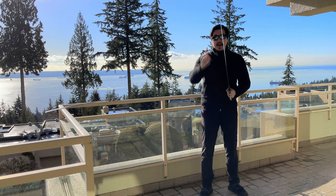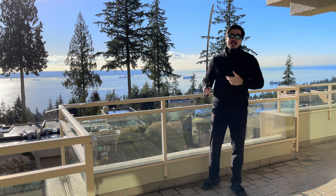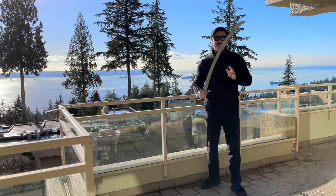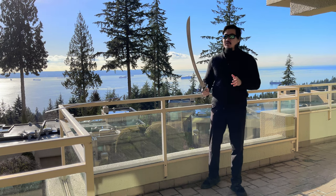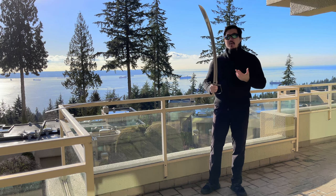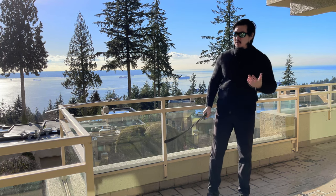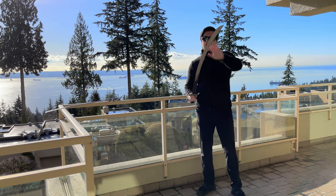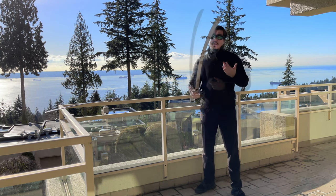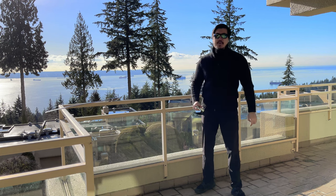the mass distribution on this blade is captured just spot on. I got two of these, shipped from Brother Nathaniel to me, and Brother Nathaniel measured both. I found that both have excellent distal taper. The other one weighs a little bit more and feels a little bit less refined in the handling, but it's still very historical. About 1 ounce heavier than this, still lighter than most Trooper's versions. This is definitely a triumph in nailing the mass distribution.